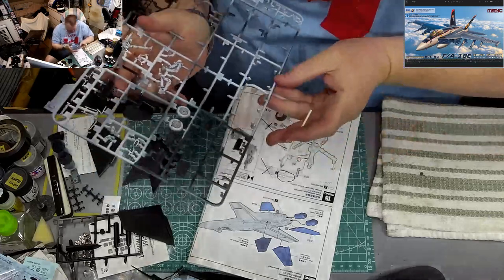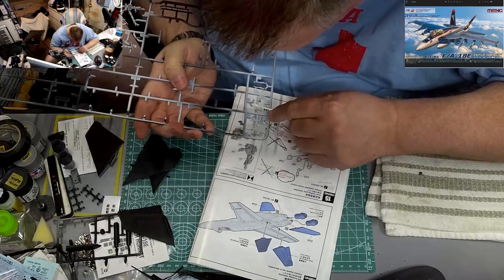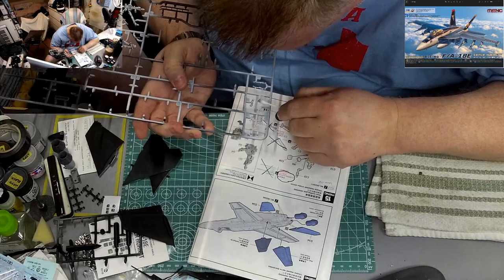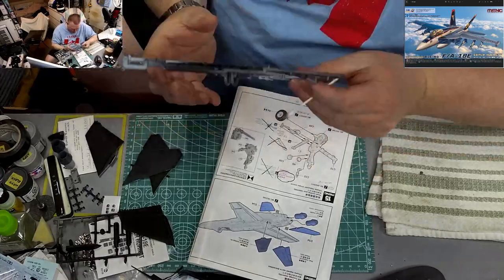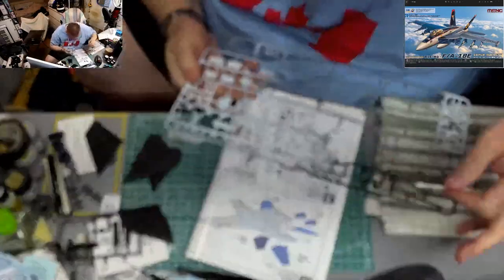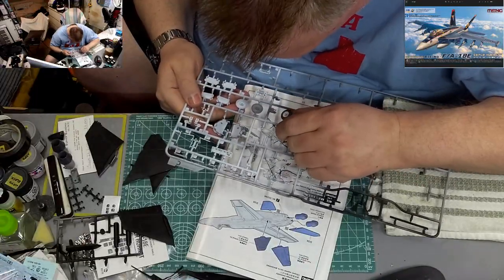So, it's just like even a fairly new hydraulic system, if you look at it, a lot of the high pressure fittings and stuff, they're going to look like they're wet from a very small amount of hydraulic fluid leaking out on them. But again, it's not really a leak. And so they call it weeping.